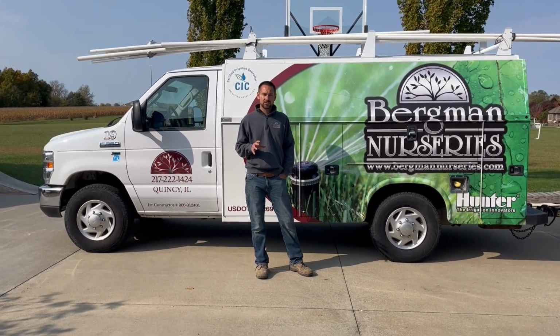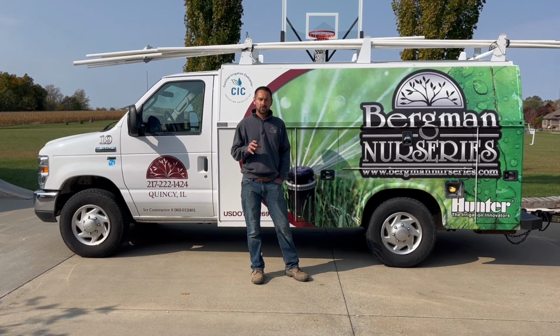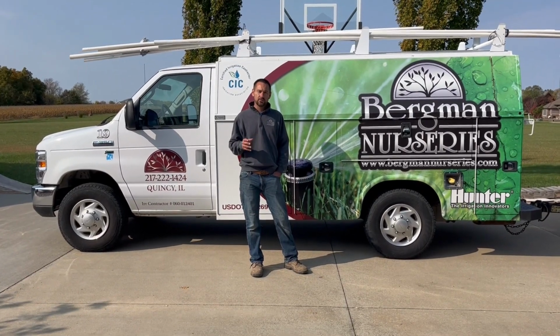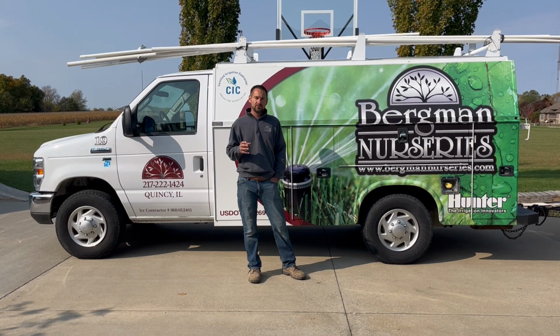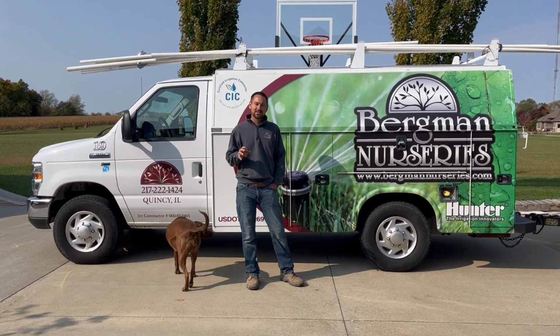actually winterize your system. There is something as simple as wrapping with the blanket, which we'll show you, or a heavy towel. We can also run the irrigation system during the coldest hours to keep water flowing through the system. And then finally, we can actually just back drain the entire backflow, and that way you're 100% protected. So I'm going to walk you through all 3 processes.